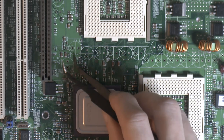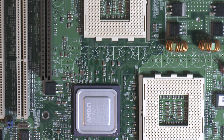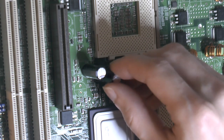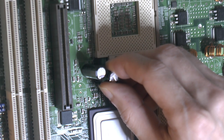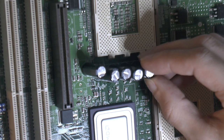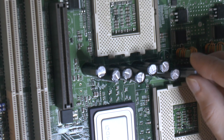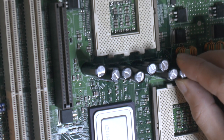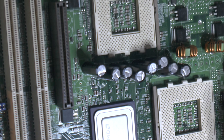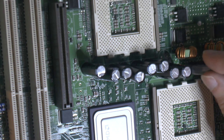There is a circle where the negative one is, and the one without, there's a plus sign. And it's also on my image. And some of these don't go the same way, they point the other way, sharing ground in between. So make sure you don't put these two over here the same way, because they are mirrored.